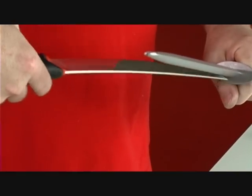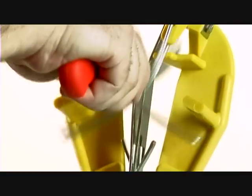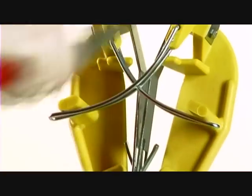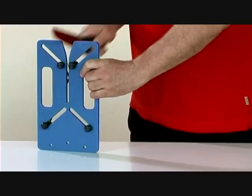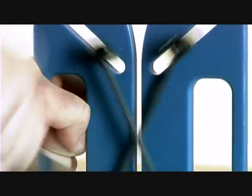The animation shows in thousandfold magnification how the burr curves to the left or to the right during cutting according to the pressure exerted. There is always a danger that the edge will break and the knife will quickly become blunt. The edge is centered and smoothed again with a sharpening steel or manual sharpening tools. The knife remains sharp for longer and does not require regrinding so frequently.